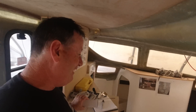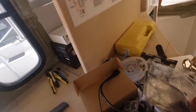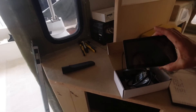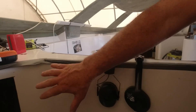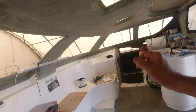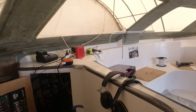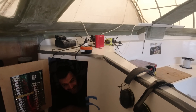They had a five-inch version but for a bloke like me five inches just isn't enough — I like seven. So I've now got seven inches of display. There's nothing like having an extra couple of inches, and I've been told size doesn't matter but apparently it does when you've got a display. We have our GX display here which is going to display absolutely everything. We've decided to position it right here on the side of our module so we can come down and just scan it without having to open doors. We were going to put it on the nav station, but I prefer it out of the way — though I'll probably watch it constantly because it's pretty exciting watching your tank levels and power levels.